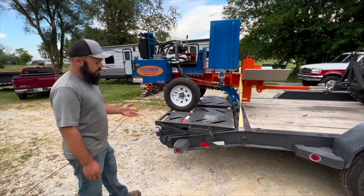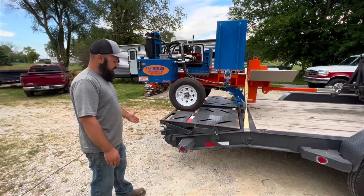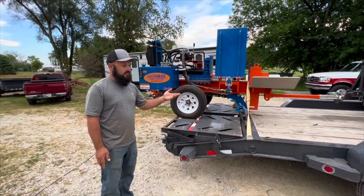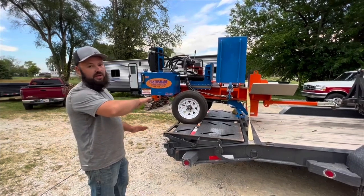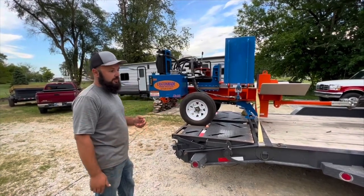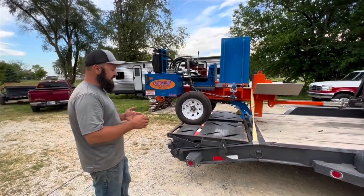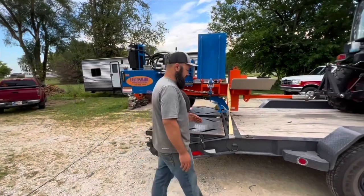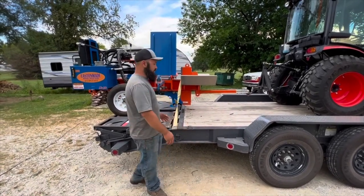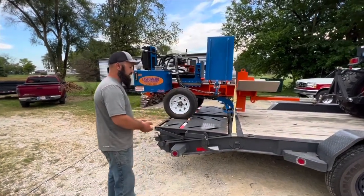This tail is maybe a 30-degree angle but it needs to be more like 45. On some of the other trailers with similar ramps, when you flip them over they sit flat on the ground — these do not. So when you load up something heavy like a heavy skid steer or mini excavator, it bucks the trailer and sits the rear end way down. That's probably why the guy behind the camera knocked the skid steer into the fender, because it really comes up. With tracks especially, there's a real tipping point — more than most trailers. I think the reason they give you that angle is because the deck height on this trailer is a little bit taller. It's about waist height on me. On some other trailers — not the I-beam style — the deck is a lot lower, so that's probably why the tail has to be so steep. Maybe if you lower the trailer 6 to 8 inches, the ramps wouldn't be as steep. But that's my only real complaint.